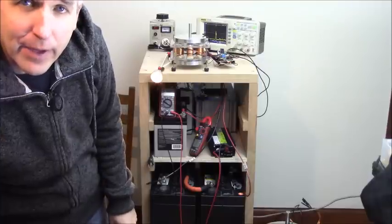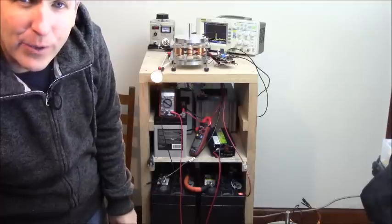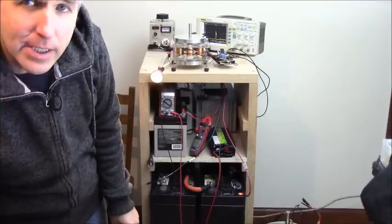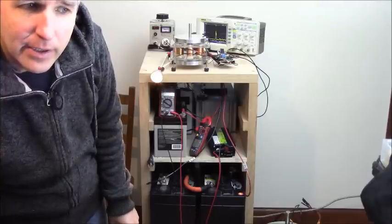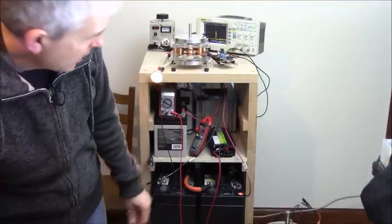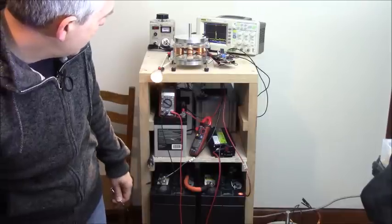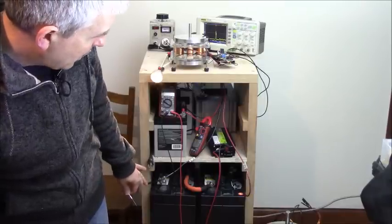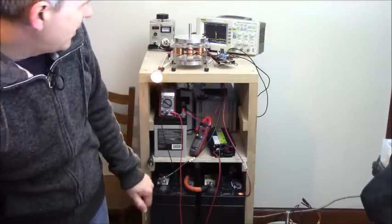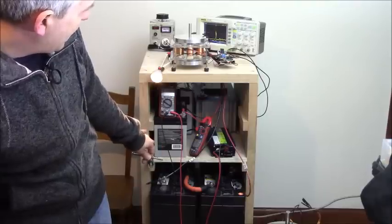So I've got a 48 volt cap bank there, 3,000 farad capacitors, which brings it down to 163 or 167 farad total capacitance at 48 volts. And I was going to show all that running, but I don't really need to set that all up right now. That was just for my own purposes later on. But anyway, I'm going to run this at 1 amp.